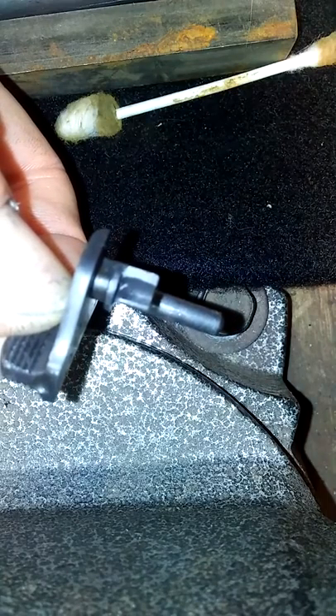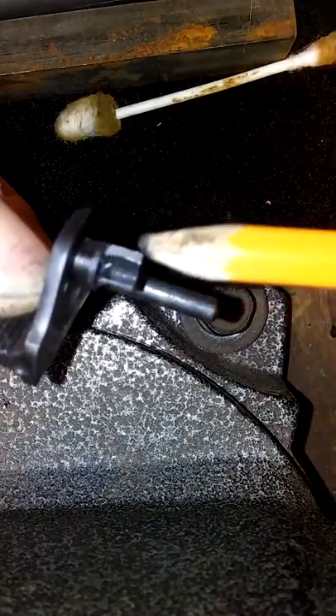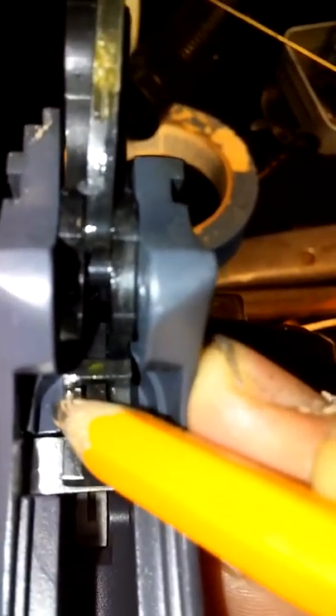Here's the top side — actually, that's the bottom side of the thumb safety. See that shiny edge right there? This is where the smith there relieved it. Right in here you can see where it was banging into the base of the sear. It's got some shiny metal right there, right where the pencil's made that mark.